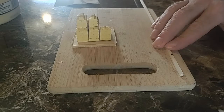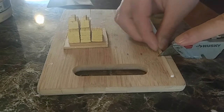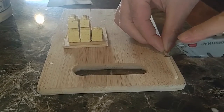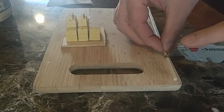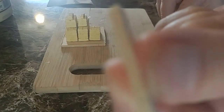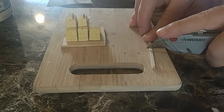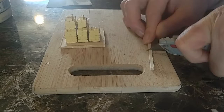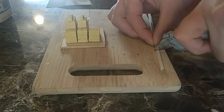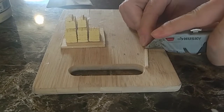For me the best way to cut these is with my utility knife with a sharp blade. I'm just going to scribe it all the way around and turn the piece of wood over at the same time. Should be able to scribe it enough to pop it loose. So there's one of the pieces. Don't worry about the jagged edges just yet — we'll address them in a minute.